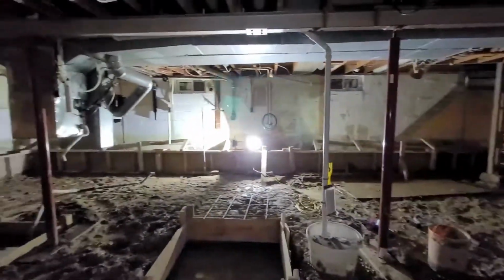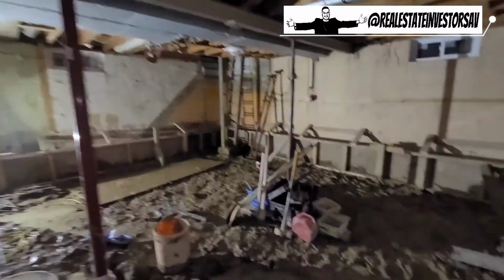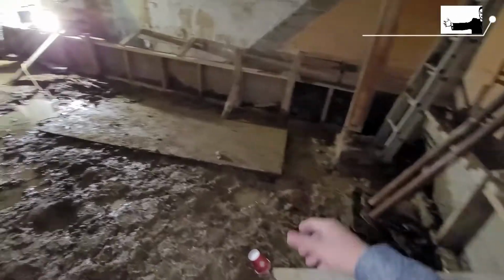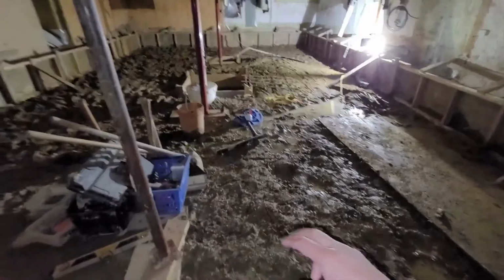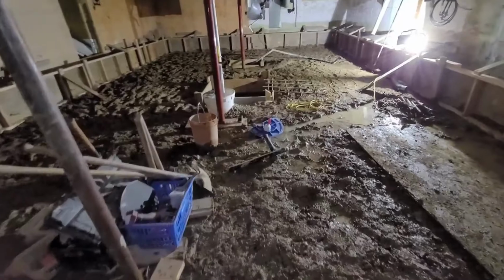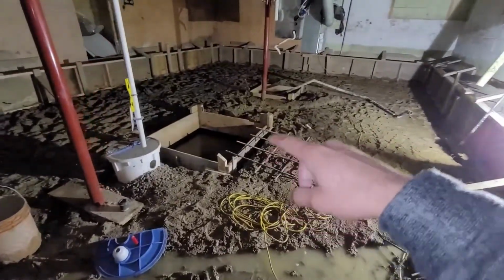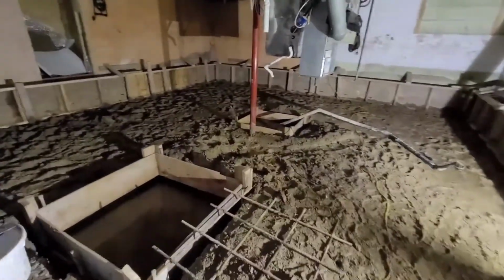As you can see, running underneath that entire beam and basically holding the upper floor in place, the old posts were sitting on old footings, something similar to what you see over here. Now, when we dug as deep as we did, if we had poured the new floor, you would have had 3 islands in place, which would have just looked really stupid because of the old footings. So the way around that was for us to start with new footings for the new posts, and you can see they're already formed in place along with the bench footing form.